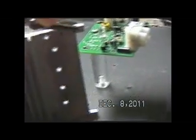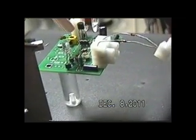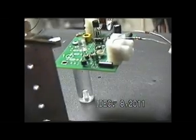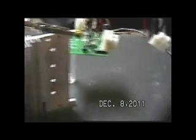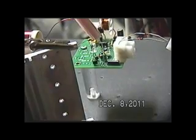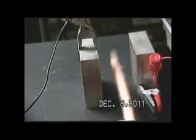Removing that bridging capacitor allows the frequency to be tuned to a higher range. And off of this aluminum block, I have added another 1 megaohm resistor into the base side of that tuning capacitor. What this is actually doing is picking up RF through this block, feeding that RF back down into the base through that 1 megaohm resistor, and giving it enough feedback to operate with this very weak signal coming in from the generator.